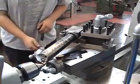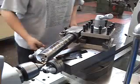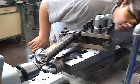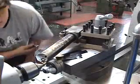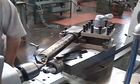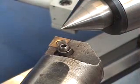If anything we want it a little bit under — just a touch under, good, perfect. We can always adjust that depending on our cutting speeds and the material and how it cuts. You can check using a center, making sure that the boring bar is at the same height.